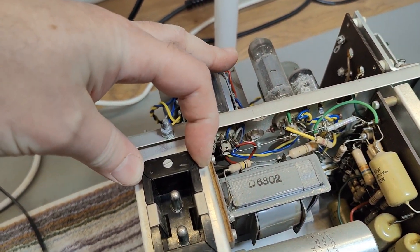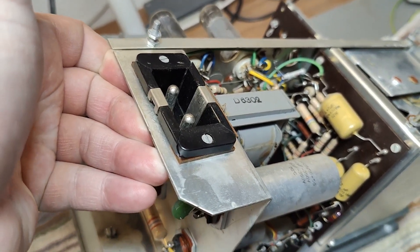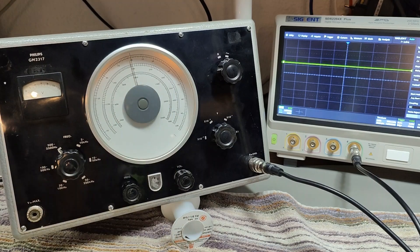Look at that one — it's cracked, but that is not causing any kind of safety risk. Let's try the first power up. That is 50 volts, 4 watts — pretty much all right, so I can easily carry on. I see light now. That is 120 volts — 150, nothing is bad here. We are now at 220 volts, and it's using 25 watts, going to 40 watts and 46 watts. That is also what I would expect.